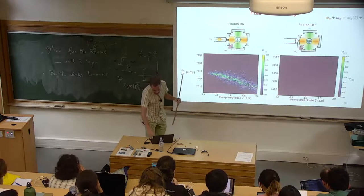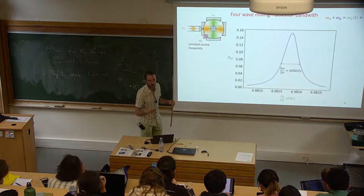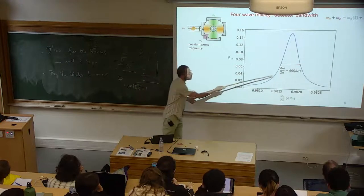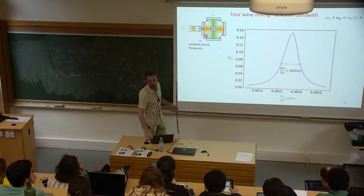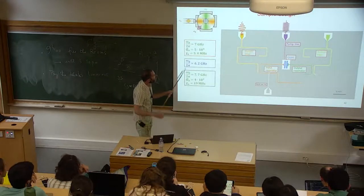So, okay, this is encouraging. Let's study it in a bit more detail. First, there is a bandwidth, right? You can measure the bandwidth by varying the frequency. The bandwidth is typically 600 kilohertz here.